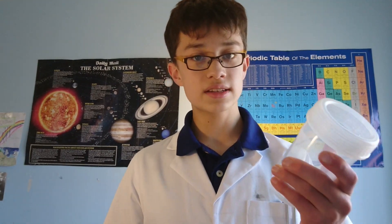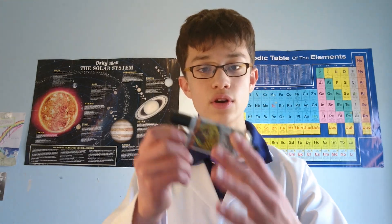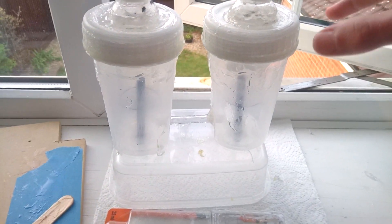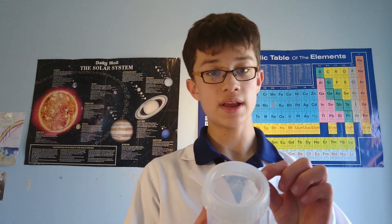Number five plastic, or polypropylene plastic, is almost impossible to glue. In fact this epoxy resin says specifically it is not designed for polypropylene or polyethylene plastic. Polypropylene and polyethylene are food-safe plastics and that makes them the most common type of plastic in the house — and this glue won't even bond them. Although the epoxy did cure on the plastic it was not bonded to it; I could easily peel it off. However, I found this was enough to stop the leaks.